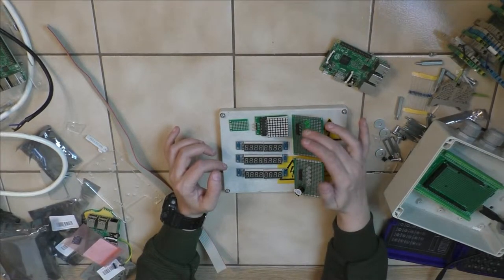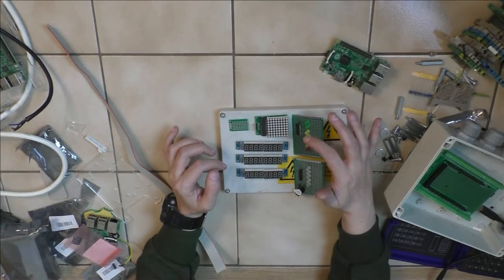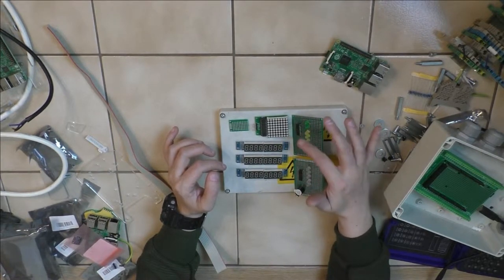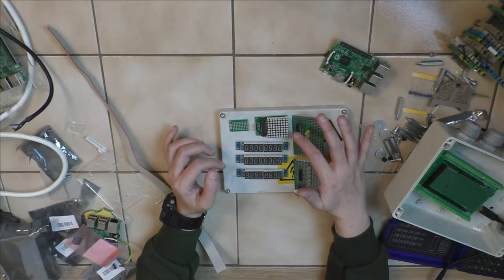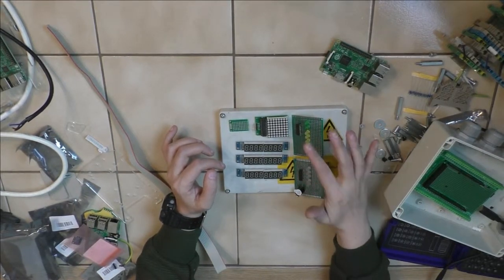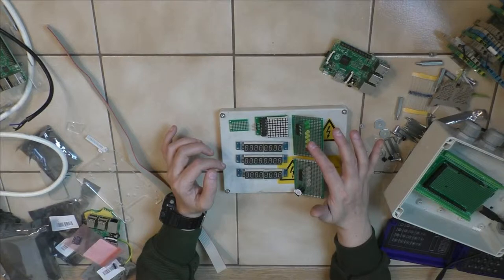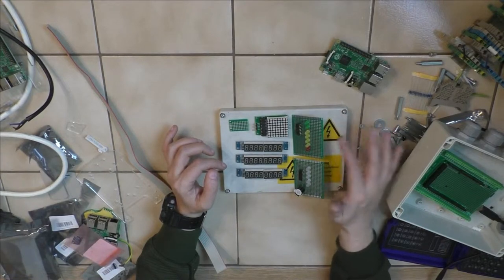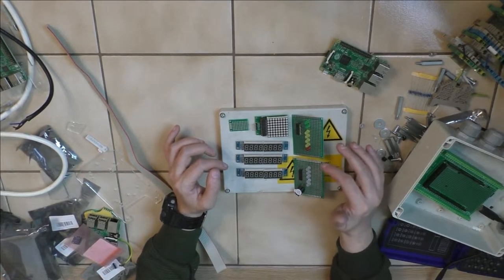And then I have a field of LEDs that I'm sending to, sort of serial here, with a 74HC595. Basically it's serial in, parallel out, and I have two of those that I can daisy chain. Here I'll print the names of the alarms or whatever the LED is supposed to mean.